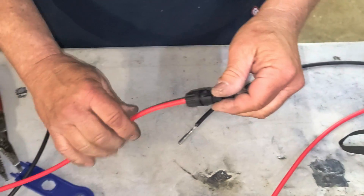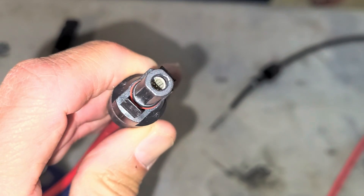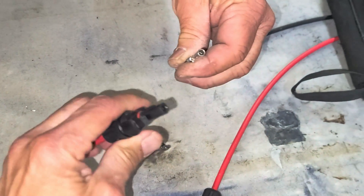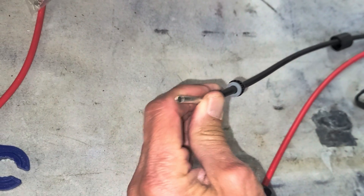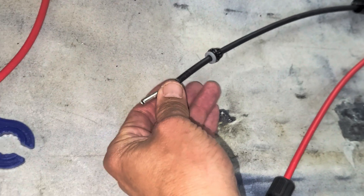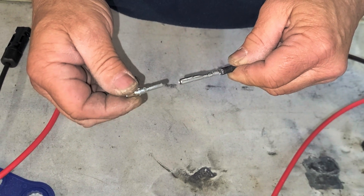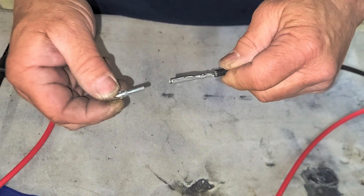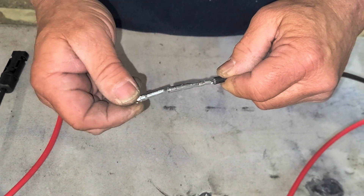What's interesting is that the connector body called 'male' actually contains a female pin inside, and vice versa. The female pin looks like a socket. Another potential problem: if the connectors come from two different manufacturers, the female socket may be too loose for the male pin, or the male pin may not be the right diameter — and potentially they could fall out. This is how they should fit: nice and snug.